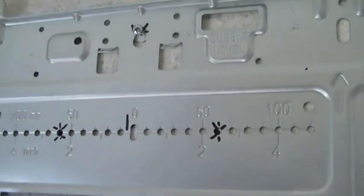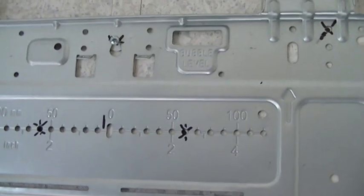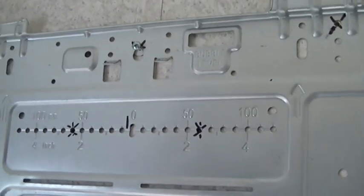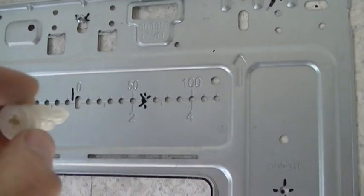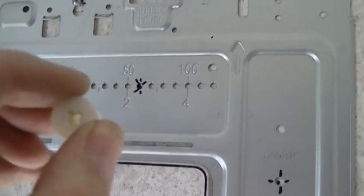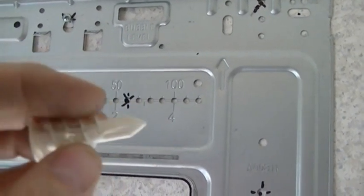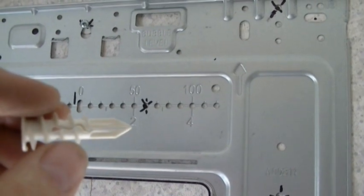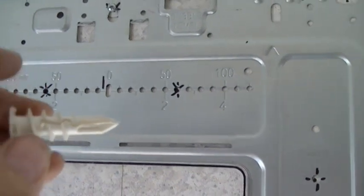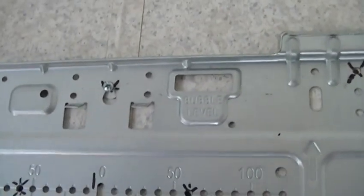I told you in the last video for my other project that I used the toggle bolts. I get them to work, and they're solid, but a little bit harder to work with. I did a little more research, and I decided to try these sheetrock anchors. You pre-drill a hole and you screw those in with a Phillips, just drive it in. And then you put the screw in and it flares out into the sheetrock. For this, it'll flare out and cause some resistance, but it's really the threading into the eighth inch panel board.